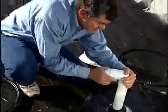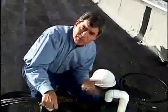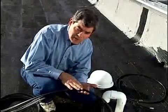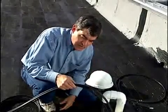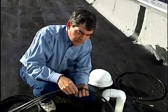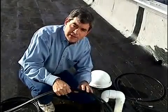Since it's passing the DC operating current to the LNB, about 200 mA per LNB, the DC characteristics of the coax cable are very important. Now the maximum voltage drop from the receiver to the LNB should not exceed 1.25 volts. This works out to a maximum loop resistance of about 6 ohms. Now we're using very good quality 18 gauge solid conductor RG6 that's been tested to over 2.2 gigs, more than adequate for a 150-foot cable run.